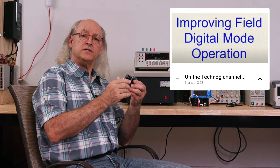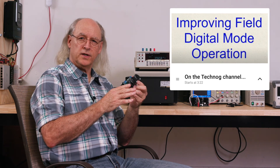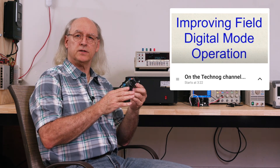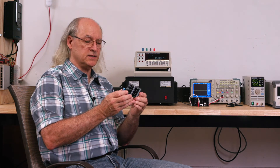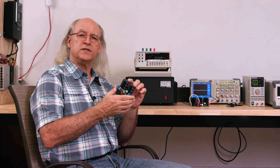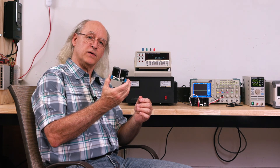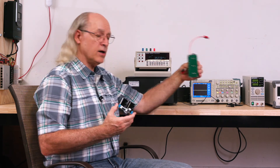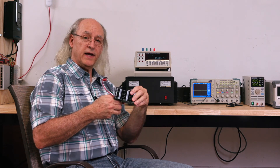The capacitor board was designed to support mobile radio implementations that were having problems during the initial stages of transmitting digital data from a battery supply. These little boards have 30,000 microfarads of capacitance, a fused power connection, and an isolation diode to protect from feeding back into the voltage source. I had the small 30,000 microfarad system built and also three that provide 45,000 microfarads of capacitance.